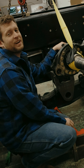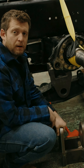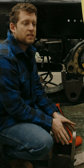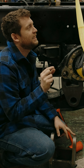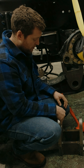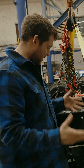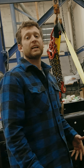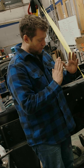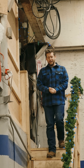There was an issue with tolerances. We designed this, but engineers love to make things fit exact — to the point where we have to grind it down a little bit. Tolerances are so important when actually building things, because what works on a CAD model doesn't always work in the real world. When you weld a plate, the heat warps it slightly, so you need to leave a little bit of clearance.